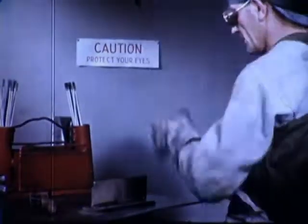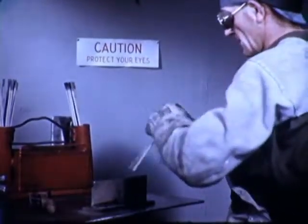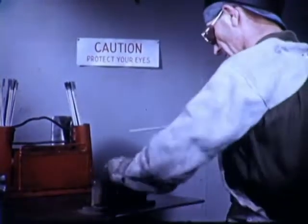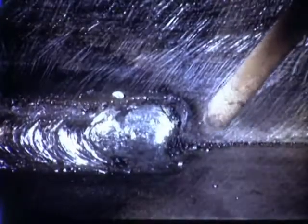When the weld being made is long enough to require more than one electrode, it is necessary that the slag be removed from the crater before the work is continued. To re-establish the molten pool, the arc is struck slightly ahead of the crater. The electrode is swung back to the rear of the crater, and the work is continued in the normal manner.